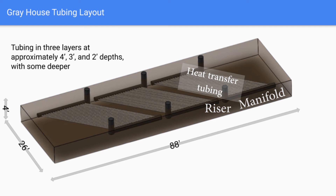During sunny days, nice warm air is generated in the greenhouse. The system kicks on at a certain set point and pushes air into the cooler ground, where the ground absorbs that heat, and it comes out the other side cooler — providing an air conditioning effect. Then later that night, the system kicks on again in heating mode: cold air is pushed from the greenhouse underground, picks up the stored heat, and returns out the other side of the greenhouse warmer than it would otherwise be.